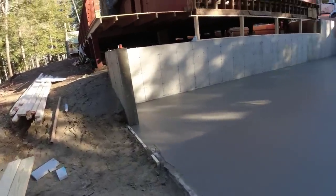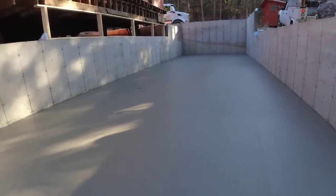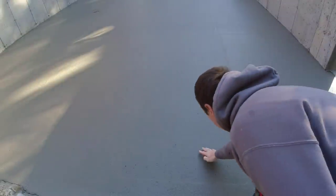It's 9:45. We probably got concrete around 7:15 to 7:30. Let's check and see — yeah, that's firming up really good for as cold as it is. Those guys will be getting on that with the power trowel here probably in about a half hour.